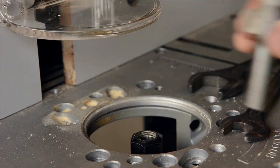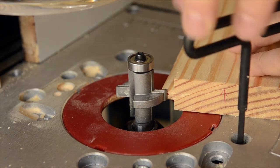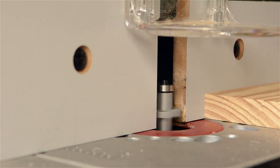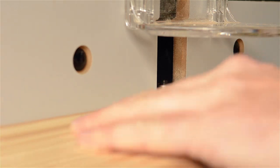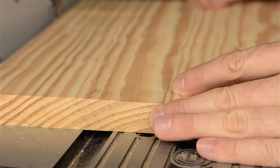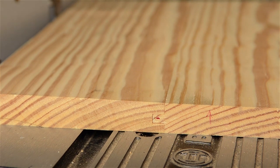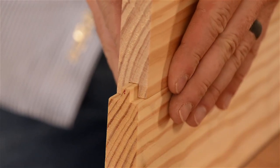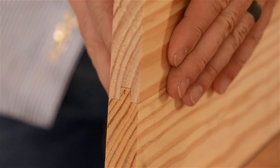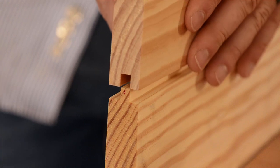Then replace the tongue bit with the groove bit. Place your tongue board next to the bit's cutter and center the cutter on the tongue. Follow the same steps and safety precautions for running the groove board through the router bit. This joint looks pretty good, but it usually takes a couple tries to dial in the right bit height, so definitely do some test cuts on boards that are the same thickness as your workpiece. Don't worry if you can't get a perfect alignment — most woodworkers and floor installers plan on having to plane or sand down the boards a bit anyway. I'll either plane the tongue a little lower or set the router table fence to cut it a little shorter, to allow for expansion and contraction so it doesn't push the joint open when the humidity changes.